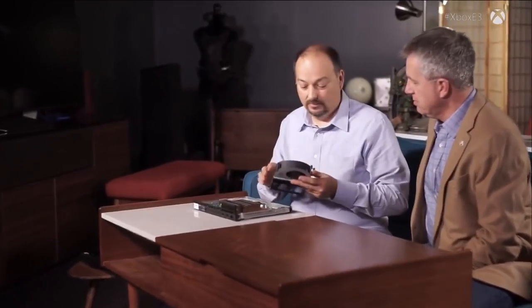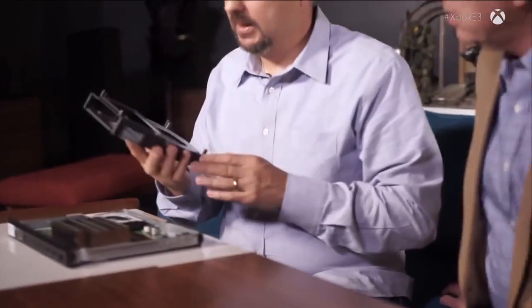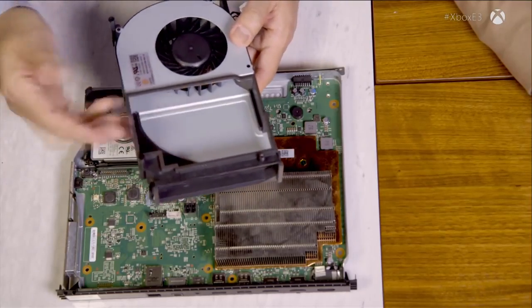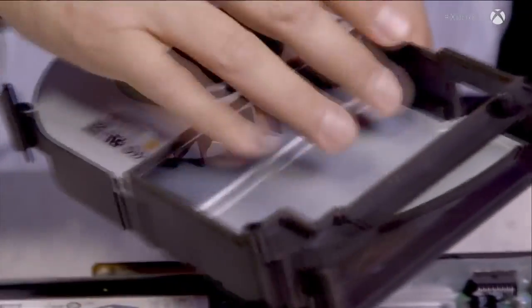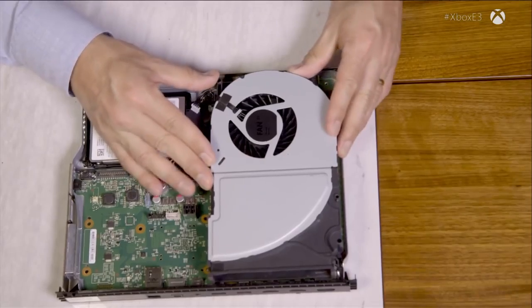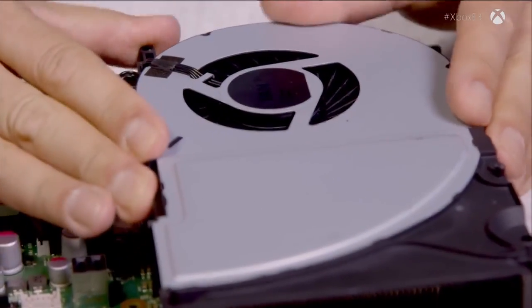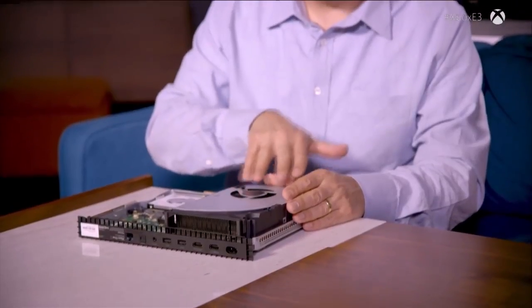In order to get that heat out of the system, we have to motivate the air — so we have a ducted centrifugal fan. We start by modeling the system as early as possible, seeing where the air is going to flow and working on designs. We use computational fluid dynamics analysis, then build models, refine them, measure how they work, and iterate to the final design. The fan moves air across the vapor chamber and the warm air exhausts out the back — drawing air through the sides, through the centrifugal fan, then blowing it out the back of the chassis.